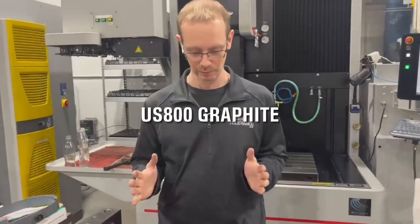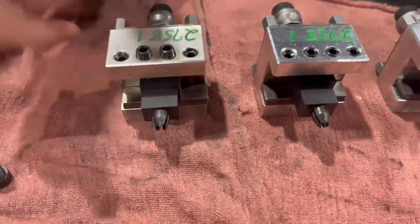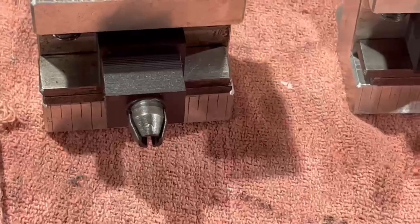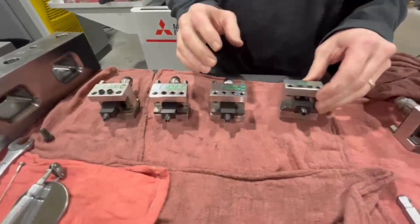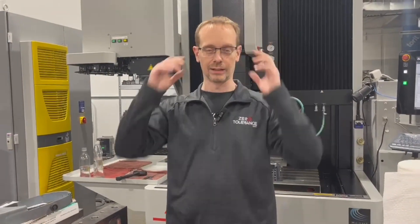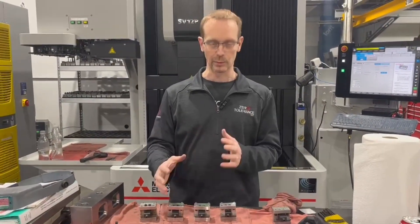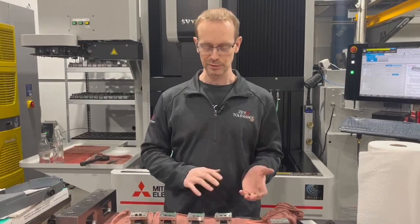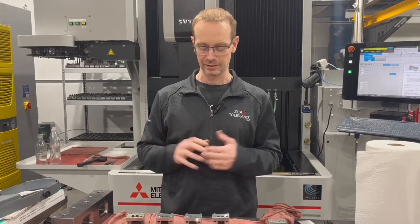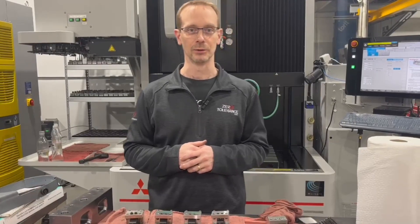Here are the results. Our mission was: can we get away with nine locations using three electrodes? We did a pretty good job. Not knowing exactly how to run this machine yet because we're still learning it, we used electrodes one, two, and three and it was very good. I decided to make one last electrode just to crisp it all up and make sure. Very impressed — doing nine spots with four electrodes is a huge advantage. Based on your overburn and what you're trying to achieve, you can get away with more or less. We had a ten thou overburn, used five thou overburn settings, and had some very good results. Thumbs up with this machine so far and we're going to be doing a lot more with it.